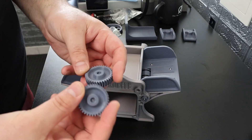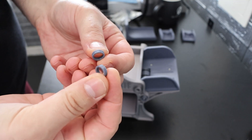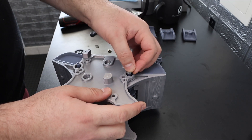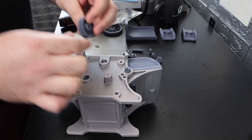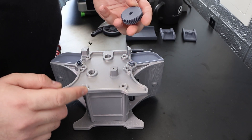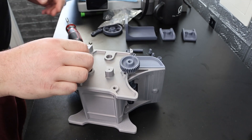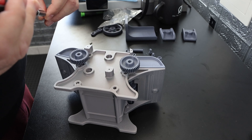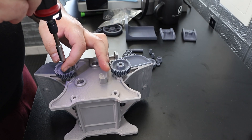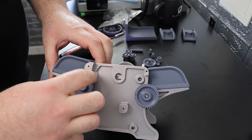For this next part we're going to need two more bearings, the two gears — they have an arrow design and they need to be pointing towards each other. We got two spacers we printed out and two more screws. We're working on the back side where the two shafts are coming out. First we load the bearings, then a spacer, and last we load the gear and screw it into place. The gear on the back has the shape of the shaft so we try to line that up as best we could. It says caution: do not over-tighten — loosen screw a little if gears bind. Those are moving nice and pretty good.